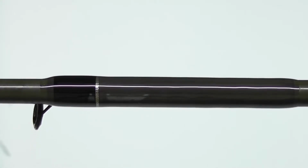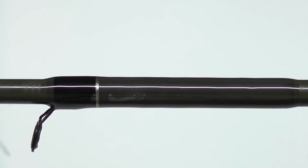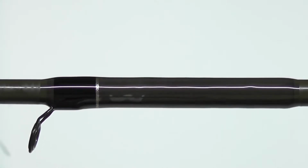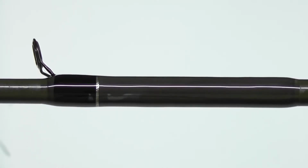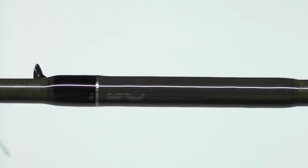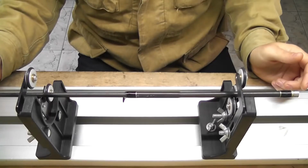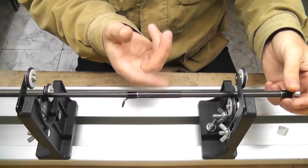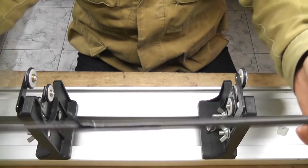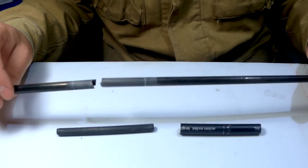As you can see, our varnish is in its place, and now we will not touch it for about a day. I mean 24 hours, but actually it's better not to touch it for 28 hours. And there's one thing: don't touch this varnish with your fingers, because we will have some marks of them here. So as you can see, the varnish really looks beautiful, really good. So now everything is varnished, our varnish is dry, and we also need not to touch it for about maybe 20 hours more.